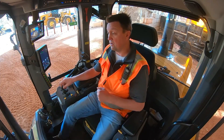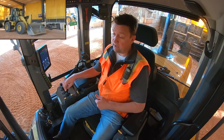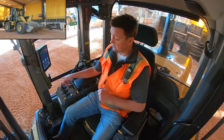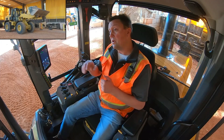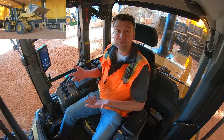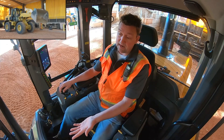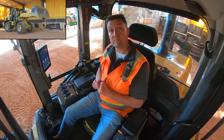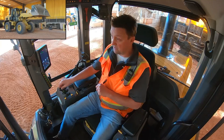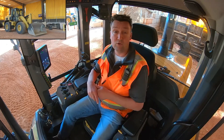What we can do now is manually rack that bucket in, then use the first of the detents by pulling it into the full extreme, into the soft detent. It's going to raise up to that target point and electronically snub when it gets there. After I achieve that upper lift, I can manually dump it back out, then recall the second detent to return to a level condition automatically with the throw of the joystick, all the way to the lower position through that soft detent.